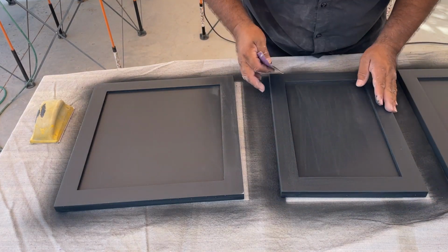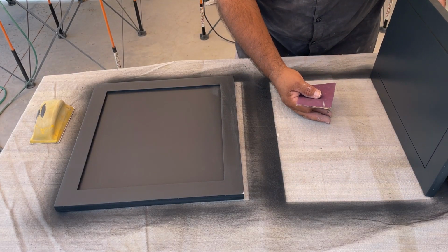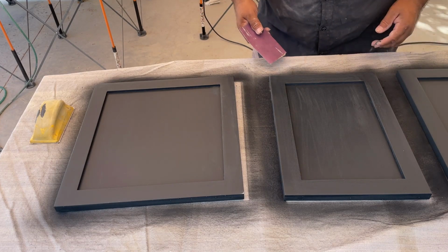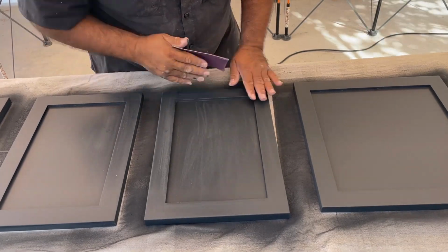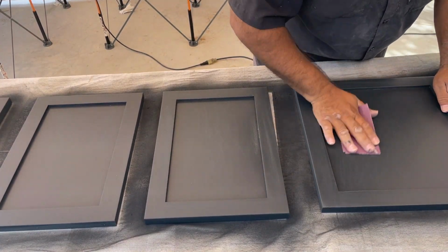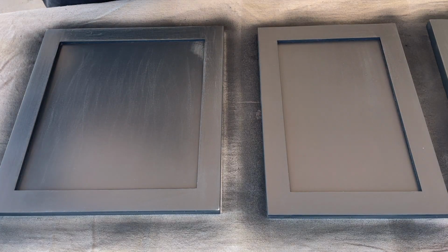Also, I put a drop cloth on the bottom where it acts like a seal, instead of masking off the backside, since I already have painted, so you won't get any overspray. That kind of seals the edges very well whenever you're spraying, so you don't have to worry about any overspray getting underneath your doors, because I'm pretty sure you're finishing the bottom sides first and then doing the top side last. So that's how I do it anyway. You might have a little different system than I do, but the outcome is beautiful. As you can see here, everything's ready to spray.